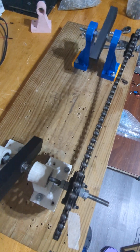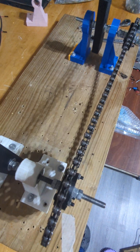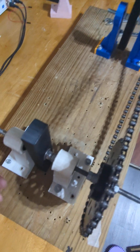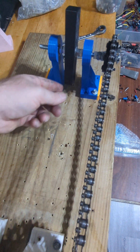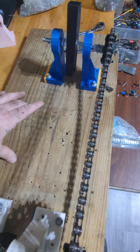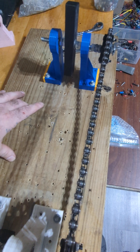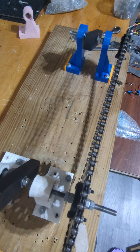The whole philosophy is magnetic neutralization. While they're both up and down straight, this one will be north and this one will be south — the coils will be in series. So the coils will have no induced voltage in them because they're neutralized.